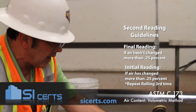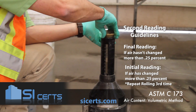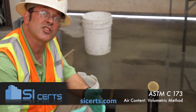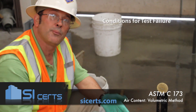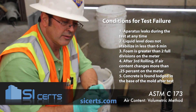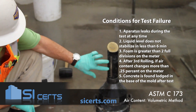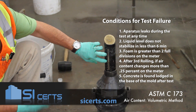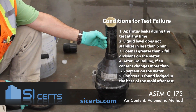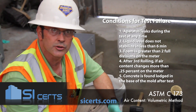If your air changed by more than a quarter percent, you would go through a third and final rolling procedure. If at that point your air still doesn't stabilize and is greater than 0.25% higher than your last reading, the test is invalid. Also, if your foam is greater than 2% of your volume, the test is invalid and you'll start again. If you do have more than 2% foam, the next time you do the test you'll want to increase the amount of alcohol used to dispel the foam.